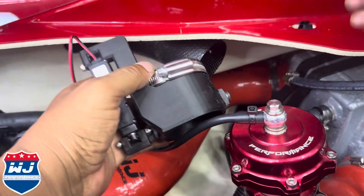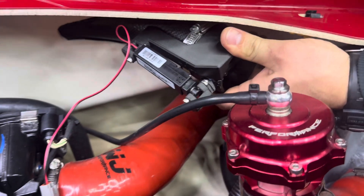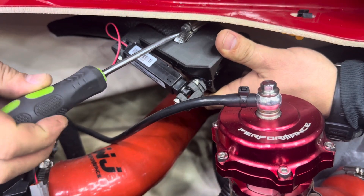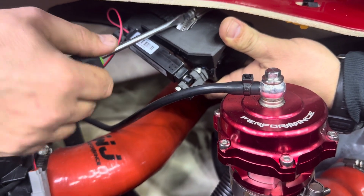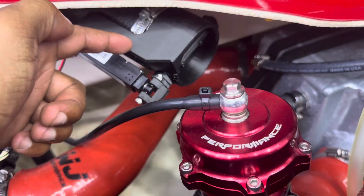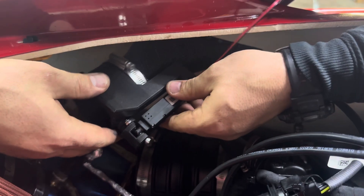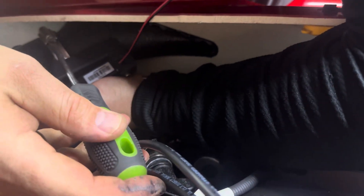You go right here where you had your manual caps, and then you put it on that side. I'm going to get my helper to do it while I'm filming. It will already be assembled. You push it all the way on — make sure it gets a good grip. Put a bead of silicone on the flange. On the inside up here, put a bead of silicone just so it sticks good and gets a good seal on there, then clamp it down. Apply a little bit of pressure and put your screw on.